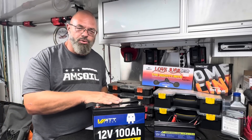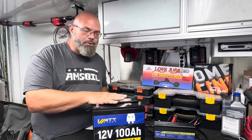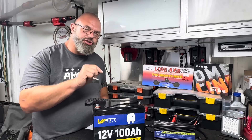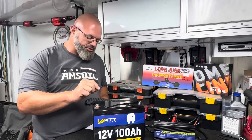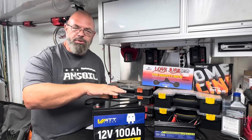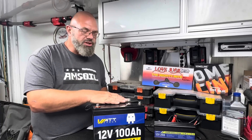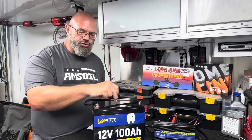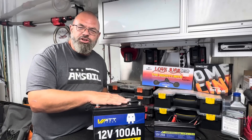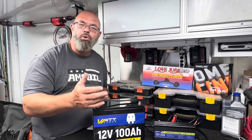Battery specifications: this battery should have a 20-amp maximum continuous charge rate going in, and it can discharge at 100 amps. That's the max continuous discharge the BMS should allow. If the BMS finds 14.6 volts or higher, it should automatically disconnect the battery to protect it, and that protection mode should be released when the battery goes back down to about 14.2 volts.